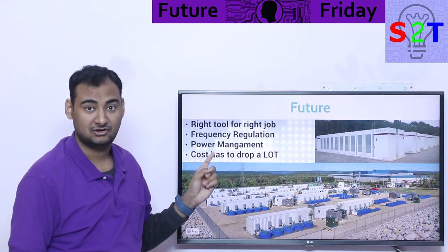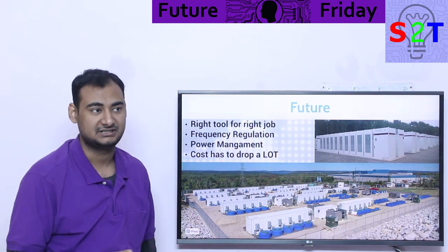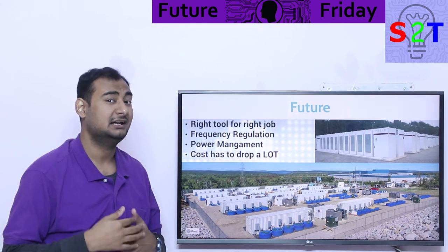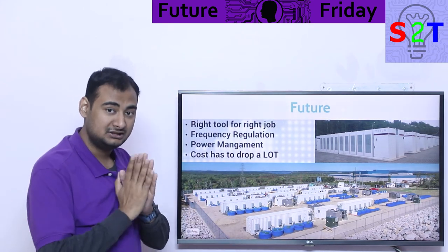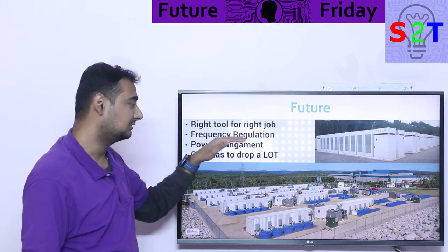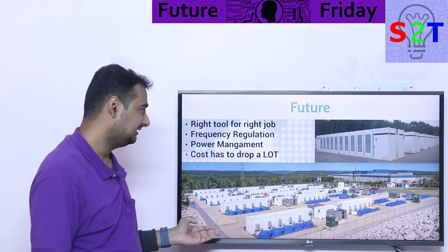That is frequency regulation. Because it's a rotating mass, and the more we remove what we call spinning mass, basically we are no longer using turbines, and we are replacing turbines with inverters. Inverters, while they are good, inherently do not have anything that is locking their frequency. So their frequency can drift wildly, and that could put unnecessary strain on the grid system. So you want something that is externally regulating frequency. There is nothing better than spinning mass, like a flywheel energy storage system.